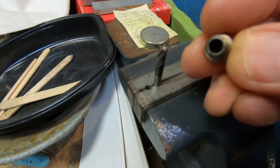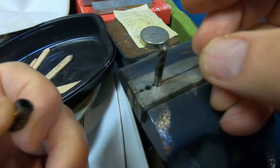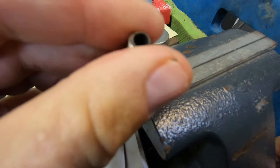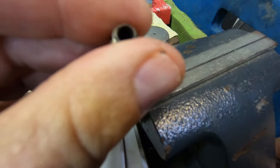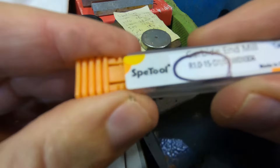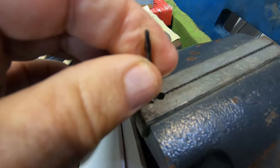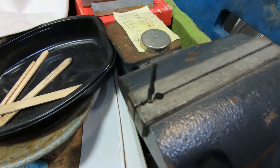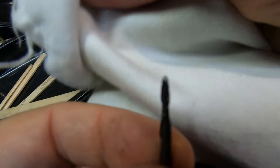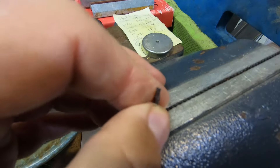The other thing we need to do: at the bottom of the nozzle, just like the nozzle tapers into a cone, there's a slight cone shape at the bottom. So we're going to use a different mill to get that bottom as clean as possible, because that's where all the action happens. Here's the other end mill — it's tapered, it's a carbide end mill with a slightly smaller diameter. I'll have a link to it in the description. The tapered end will get down to that cone-shaped area at the bottom of the nozzle. We'll put this in the bench vise again and do the same thing — this is getting that last little bit right up against where the 0.4 millimeter point starts.